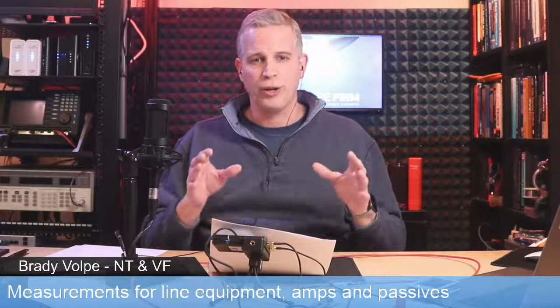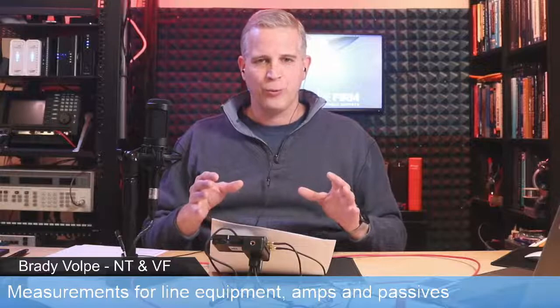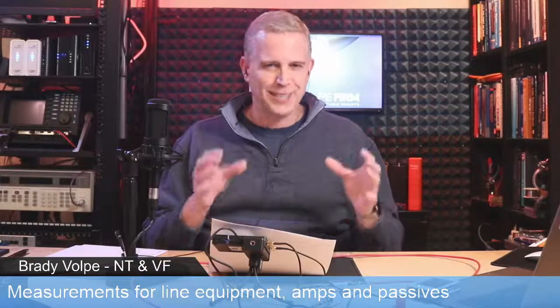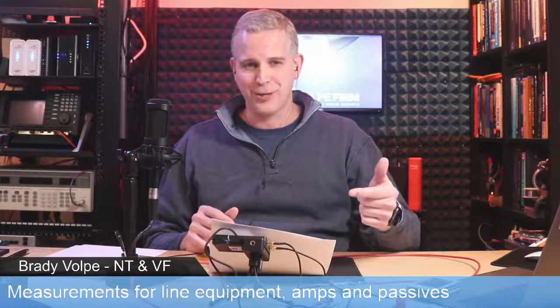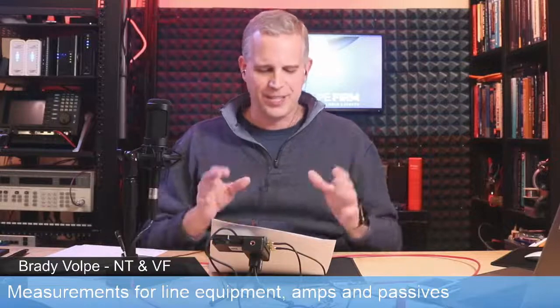We're going to be showing what return loss is, what insertion loss is. We've been doing lots of things where we find bad equipment, but we can't actually get to the root cause and really understand what that is. We're going to be showing you all about that today. We're going to be showing you why it's important to terminate, what end of line terminators do when they go bad. We can actually see that in there.